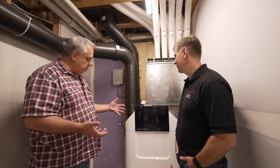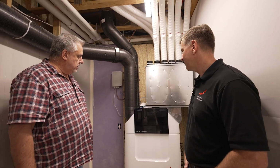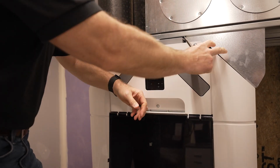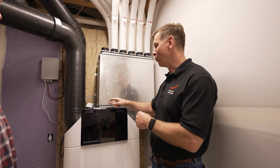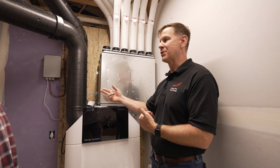So talk us through a little bit in general about exactly what this system is, Chris. Yeah, it's basically an air exchange system. When you detail the envelope the way you've put all those air sealing details on all the junctions, this house isn't going to breathe, not very much. So we now mechanically need to introduce outdoor air, and we need to exhaust the stale air.